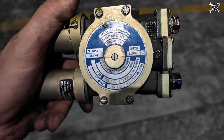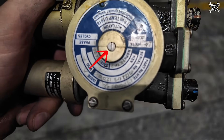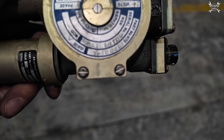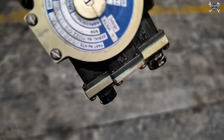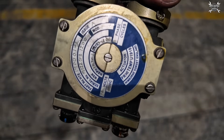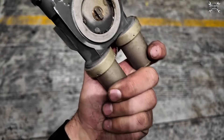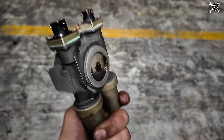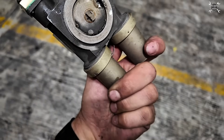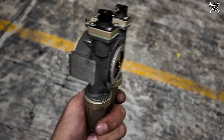Here is a visual indicator. Thanks to this we know if the valve itself is closed or open — right now it's closed. Whenever these two lines are aligned, the valve is open. Thanks to the separation of the valve and actuator, you can quite easily replace just the actuator without opening the fuel line.